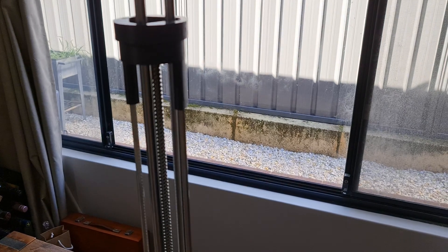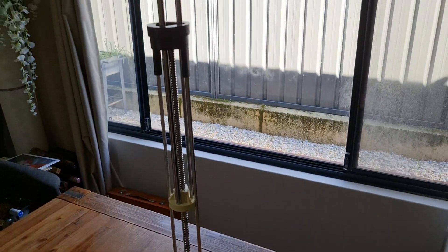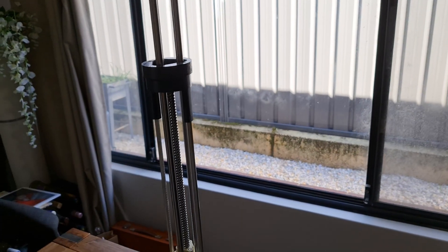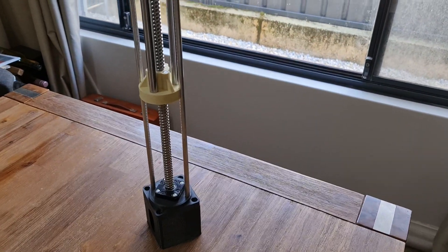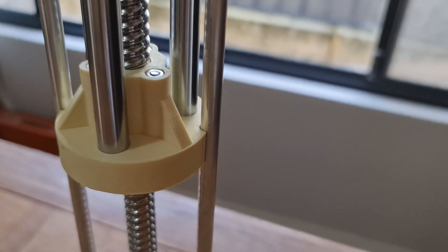The total travel is about 540mm out of the 600mm ball screw, which is not bad because my other actuators were about 350–370mm and that's only a 500mm ball screw. These actually come in exactly the same height as my old actuator, so I'll be able to run this one alongside the other five I've got and just test it out.